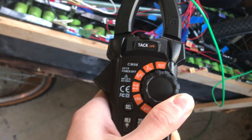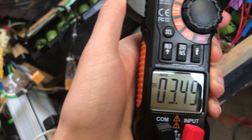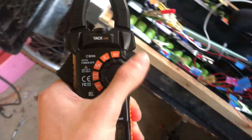This clamp meter is handy because when you know your batteries are done charging, you select DC on it and it'll show zero current. Right now I'm getting about three and a half amps — it's taking more current now. But this will go to zero when fully charged, so that's always helpful. A DC clamp meter is definitely a must when dealing with e-bike DC current. So yeah — thank you for watching, do subscribe to my channel, and like and share this video to help out the YouTube algorithm. See you in the next one.